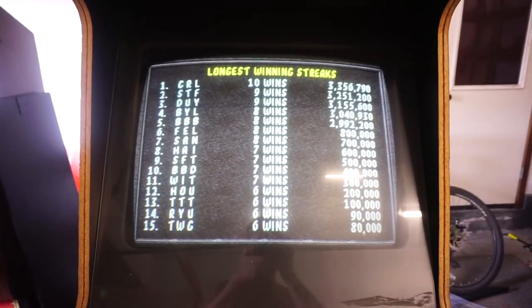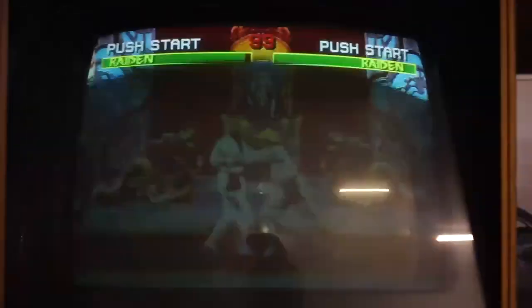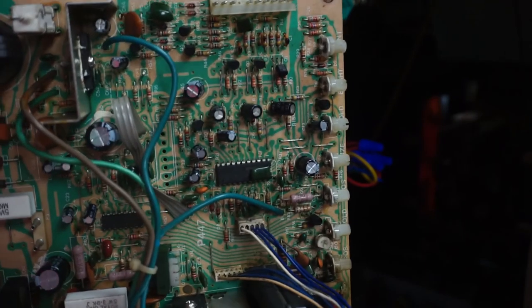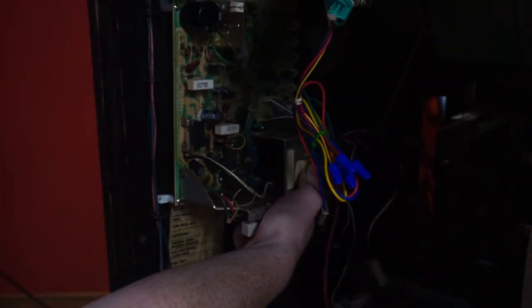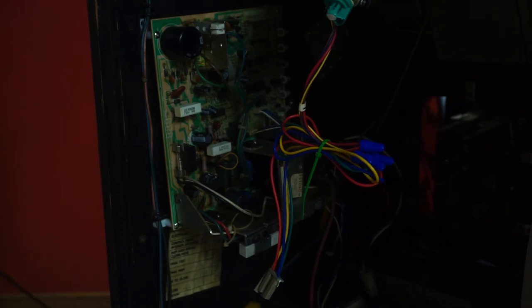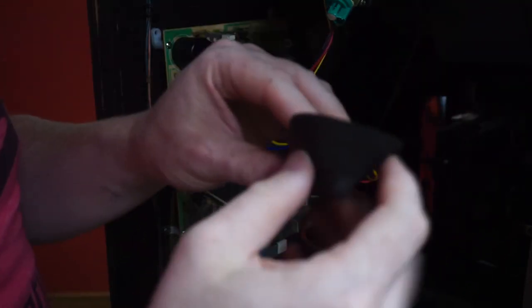The real bonus with the K7000 is that it supports a wide band of yokes, so much so that you can pretty much pick up any consumer tube with the right size neck and expect it to work within reason. Unfortunately, I don't have the pan that goes under the chassis, and the original frame supported the original chassis in a very strange way, so I'm just going to add PCB feet and install the chassis to the inside of one of the wood sides of the cabinet, which is where I had the universal chassis.